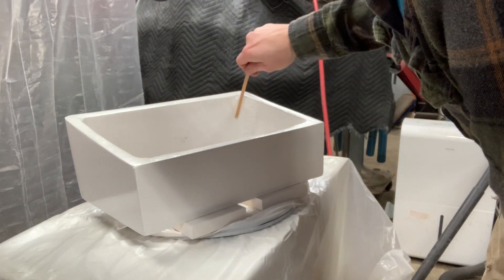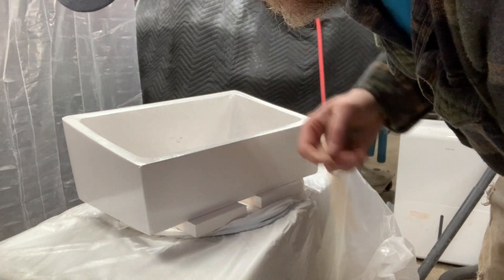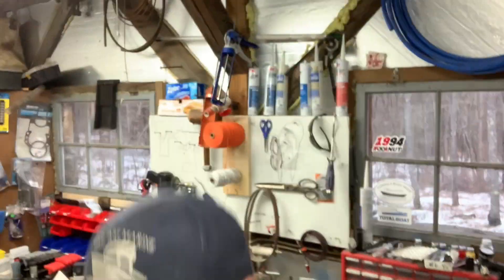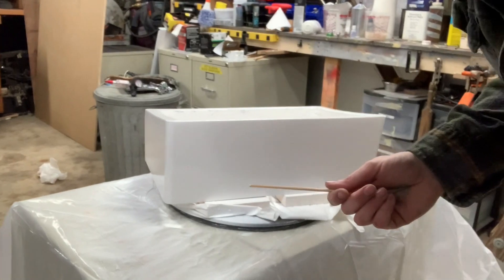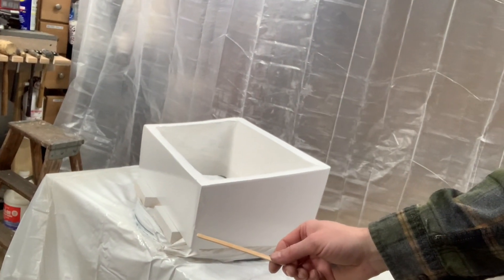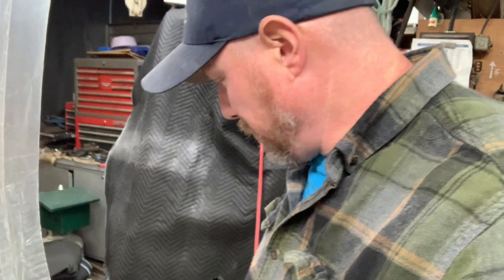Other than a couple of pinholes that I think were from some solvents flashing, it looks pretty good. There's a couple of little holes there and a couple right there. I probably should have run my hairdryer over this — I always do that — but I didn't because I was filming and not paying attention to what I'm doing. There's a little bit of orange peel here and there, but I'm okay with that because it's just coat one. What I didn't notice in the sanding is that there's actually a couple of little dings right there — that may have happened when I dropped this.